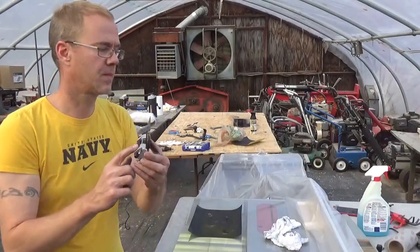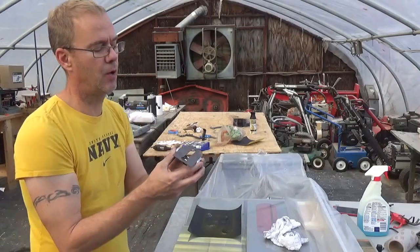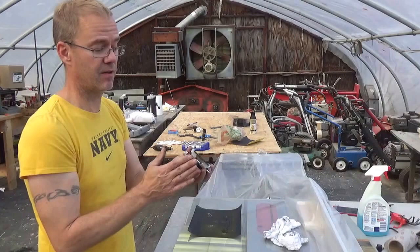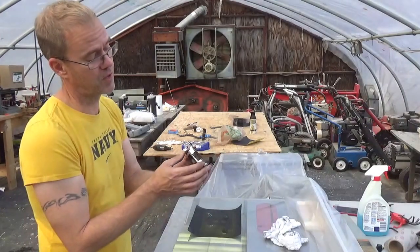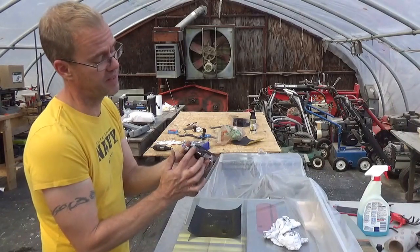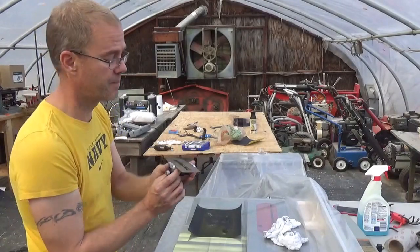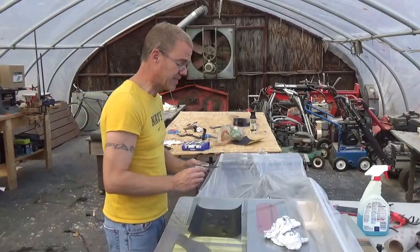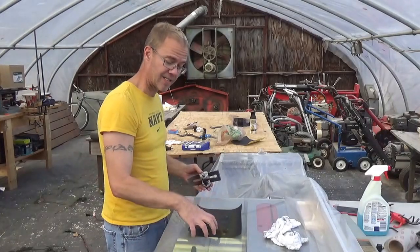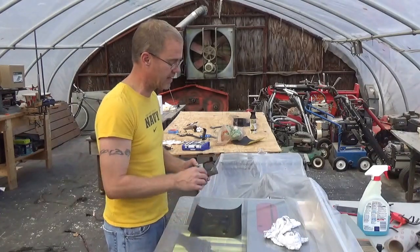It's called a honing guide, and we want to have a 25 degree bevel on this cutting iron. So according to the instructions, you put it 2 inches out from this edge right here, and that's going to give you 25 degrees on the bevel. And it's pretty simple. You tighten it down. What I'm using, again, this is on glass and then on top of my table saw, so it should be completely flat.